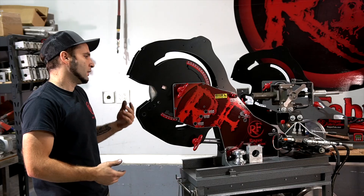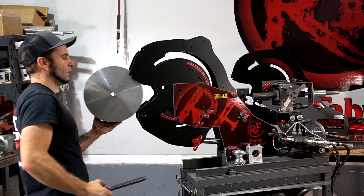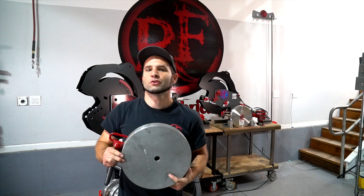If you have billet spacers it's even easier, because when you pull the die out you won't lose any washers like I just did. Spacers are great for convenience, but you absolutely do not need them to change dies.